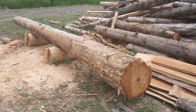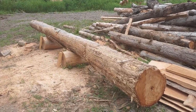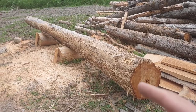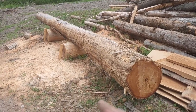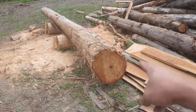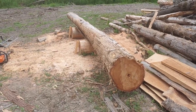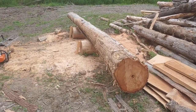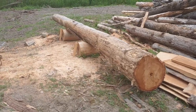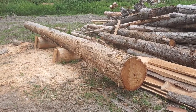I'm gonna try and make one long cut all the way across and make one big long beam, then cut it up into smaller pieces that I need. That way I avoid setting up twice — if I cut it in half I'd have two logs and have to set up twice. I don't know how far this rot in the butt goes up, so I'll make one long beam and then figure out how much length we have and cut it to our desired length.